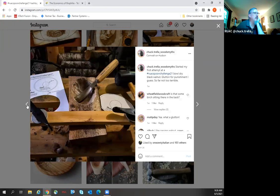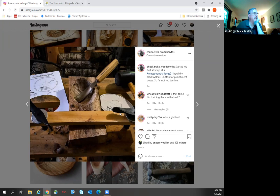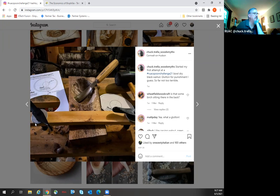So that was my setup that I was talking about. Those clamps are surprisingly inexpensive. They're like $18 on Amazon. Or the screws, they're not clamps, they're screws. But I did have to go and buy these big washers to put underneath it. Because otherwise, if you try to have it sit flush with the wood, the bulge of these little wings, they don't turn. They will collide with the wood top. So you have to have these nice big thick washers underneath to raise it above the level of the wood. You can do it a little bit, but it scars into the wood. That's how they get you.